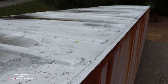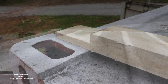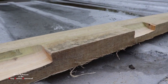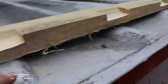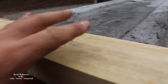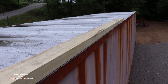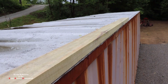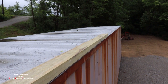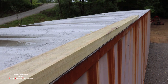We're going to build off of them. There's going to be a wall going in the center of this, and then there will be a lip over there we can nail to to get our eave on there. I'm going to show you how I did this — this is the first one I've done. I got that one a little goofed up, but it works. Then I figured out the rest of them all the way down through there. As you can see, they're all notched for all these grooves. When you flip this over, it's going to lay nice and tight right on that rooftop all the way down through there. That wood might be a little bit bowed, but we'll bend it as we go and straighten it up. Looks like a lot of notching, but wait until you see how I notch them.